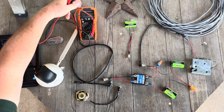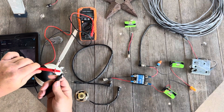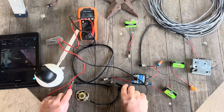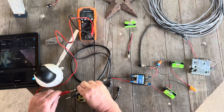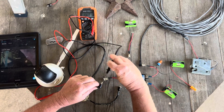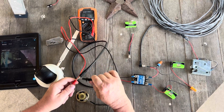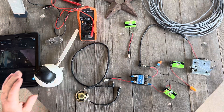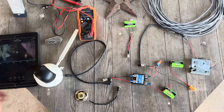I've got a digital multimeter here, set on continuity, so when you touch the leads together it beeps. We can check what we use for ground — cable's good there. We'll check what we use for positive, which is the center pin — that's good. And to make sure our cable's not shorted, we'll check center pin to the outside pin, and of course we don't have a short there, so our cable's good.